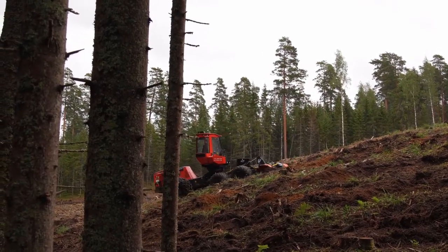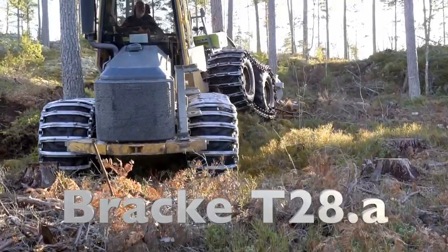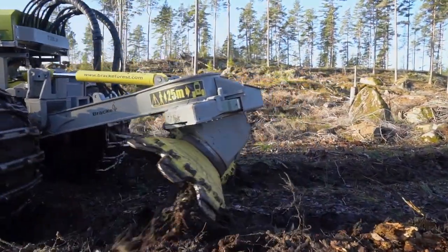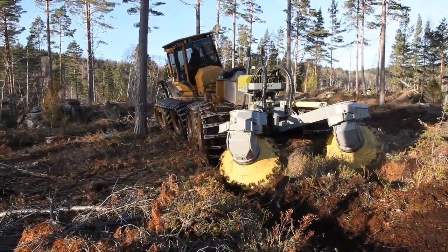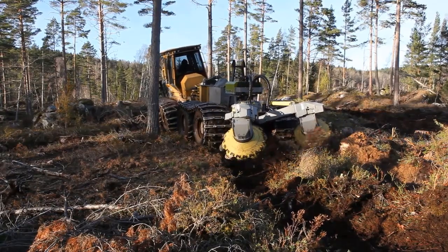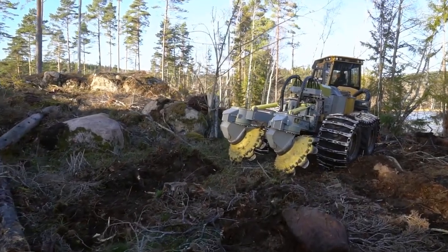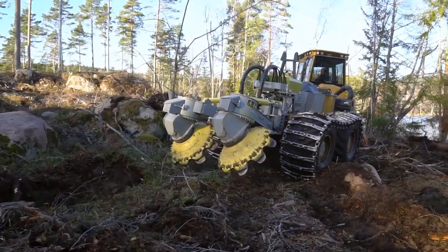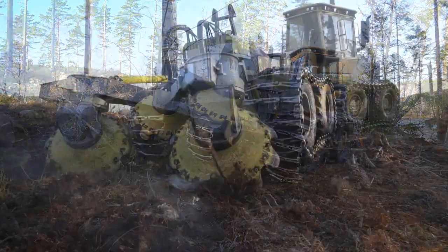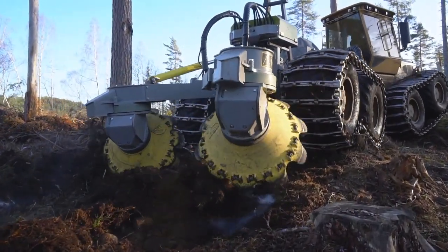Operational techniques. When pulled through a reforestation area, the discs rotate outward forming 2 parallel furrows approximately 6 feet apart. To the outside of each furrow, side cast material forms a loose berm containing organic matter, mineral soil, and slash. Furrows are about 6 inches deep but can be made deeper by adding weight to the machine or by changing the angle of the discs. Some models provide downward pressure from the prime mover which will also deepen the furrow. The models that have power-driven discs can go through more material and provide a deeper furrow than the freely rotating disc models.